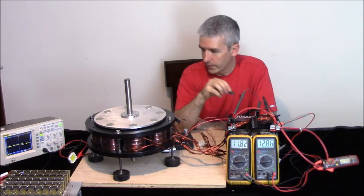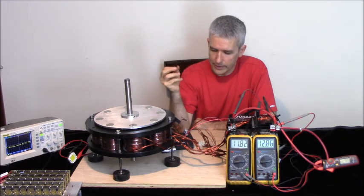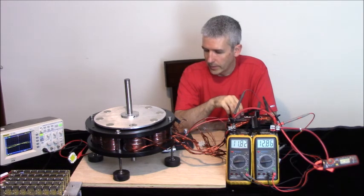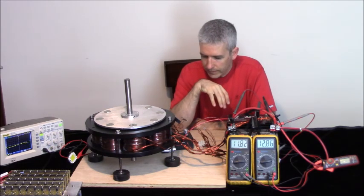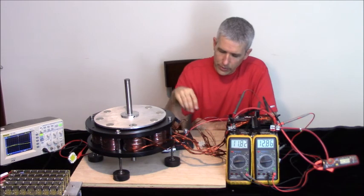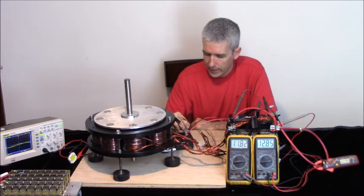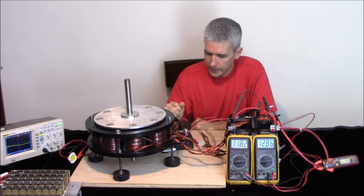Now what I found was, as I mentioned in the last year or so, these high speed ultra fast diodes here make a big difference in the output, and you can see the spike on there as well, the difference between the slower diode. So we have a good gate driver on here now. There are 2 forms of speed control, the pulse and the width, on this box here, and then we're just controlling the off time on the speed control here that will adjust the amperage, which I'll show in a minute.